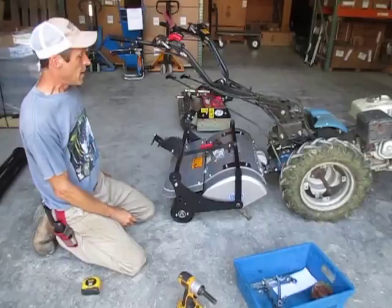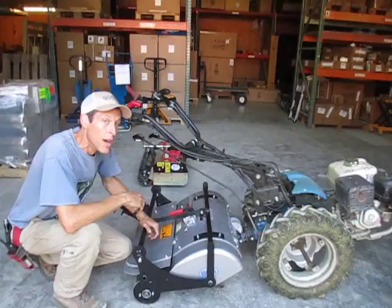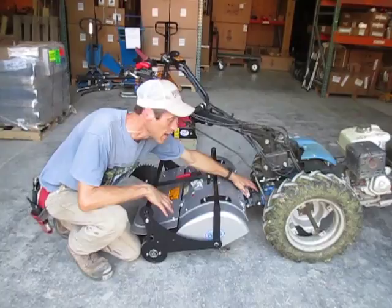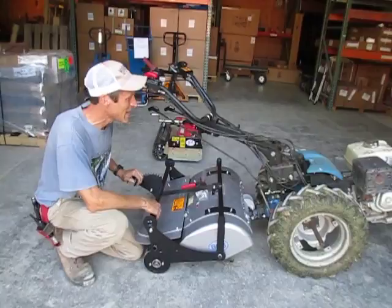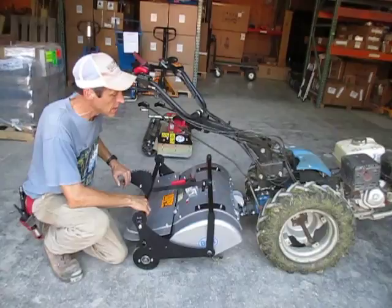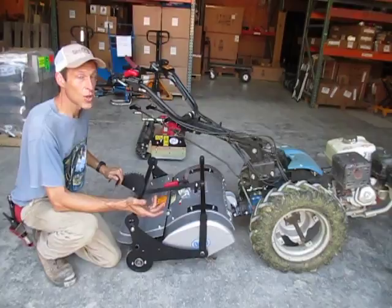On the Earth Tools version of the Precision Depth System, we've left the quick coupling in place. Unlike some other precision depth rollers on the market, we didn't feel the need to shorten up the coupling distance by that extra three or so inches, because this roller is already six inches shorter than the BCS America version. Now that we have our quick coupling system still in place, we have a versatile tractor where we can remove and install implements easily — most small farmers run multiple implements on their walk-behind tractor, not just a standard rototiller.